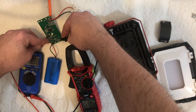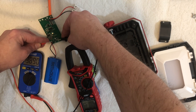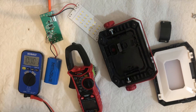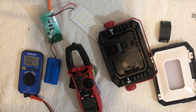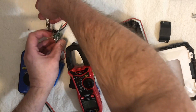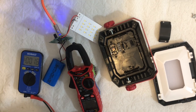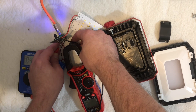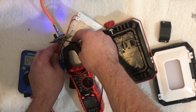These didn't completely finish charging but they were in the constant voltage stage. We're at about 3.89V, still rising a little — probably going to stop at 3.91–3.92V. That's a pretty big drop considering they were in the high fours before. With the charger on it's a power bank, and we've got not quite 2A going in, which tells you we're in the constant voltage stage — getting 4.11V — although that tells you it's not actually charging at 2A since it could go higher.